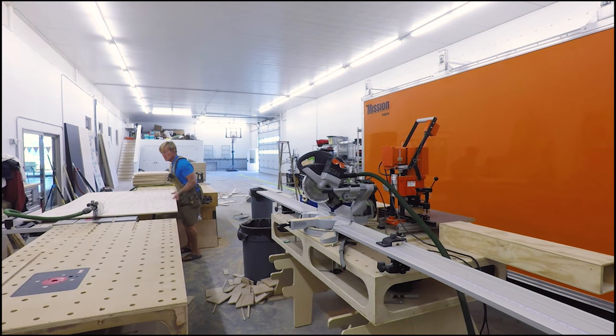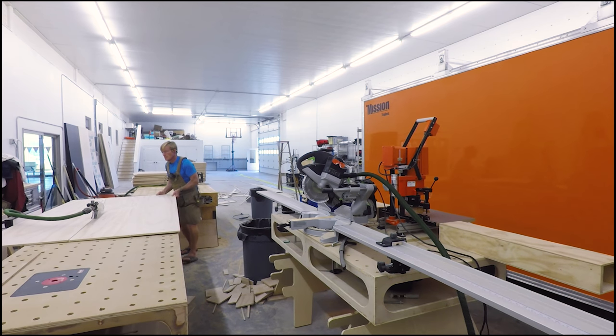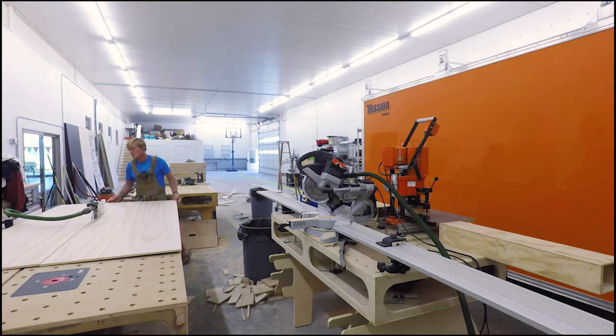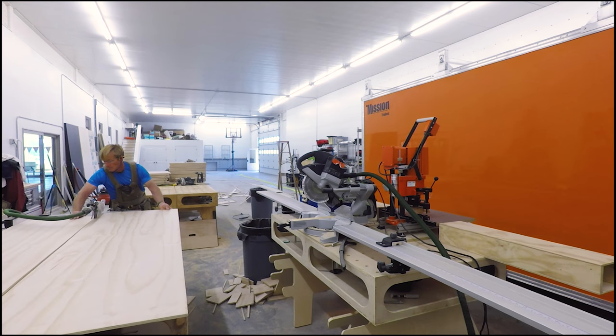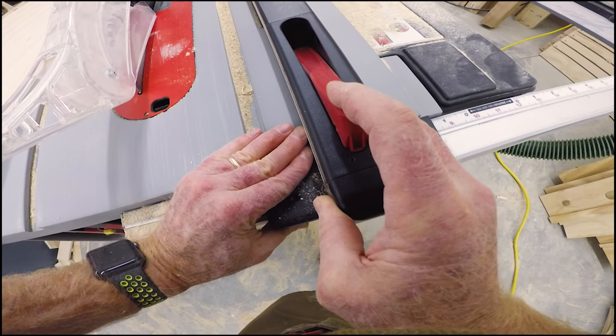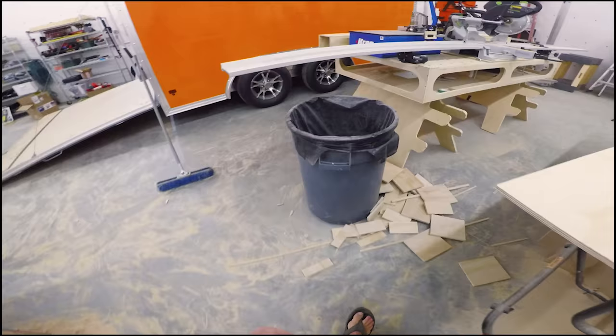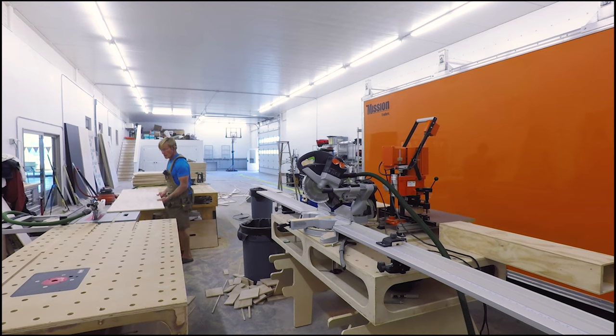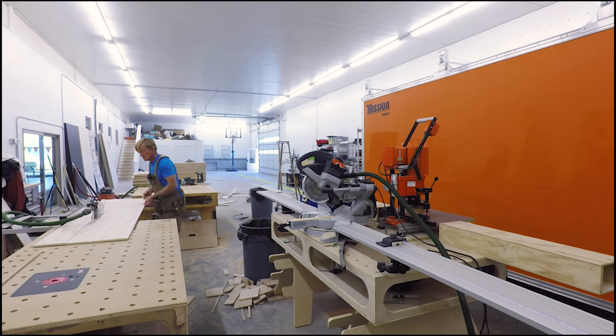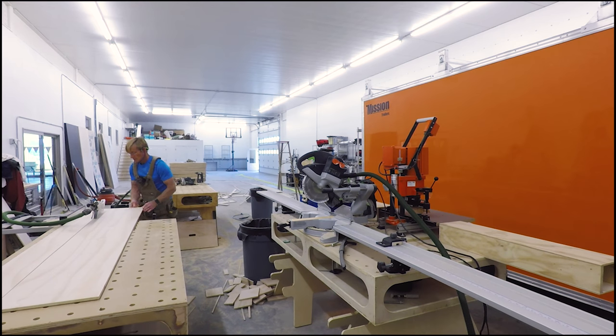What I'm doing is setting the fence up to cut a wide enough piece to make three strips long enough for the sides, then readjusting the fence and breaking those wider pieces into three pieces each — just using the best tool for the job. I don't like to move fences or stops, but in this case I did and used the numbers to dial it in, then grabbed a piece of scrap to do a test cut to make sure everything would match up. Then I ran those wider pieces through for the final cut.